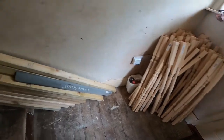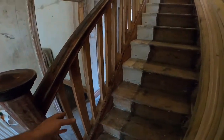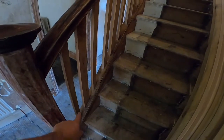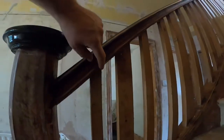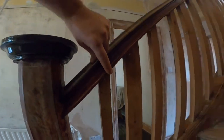In the upper part of the staircase we're going to be putting it in from scratch. This is probably the easier bit. On this part of the staircase we need to take these spindles out, we need to put a bottom rail in - I've got the pine bottom rail upstairs - and then at the top here we're going to need to do a bit of notching to put the new spindles in.